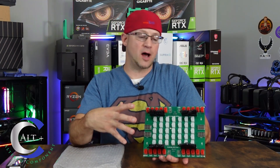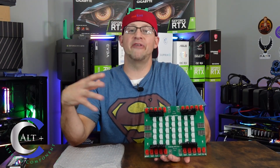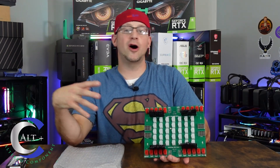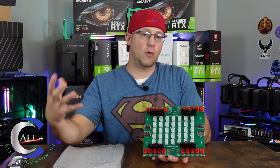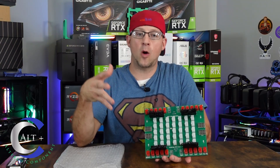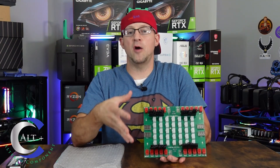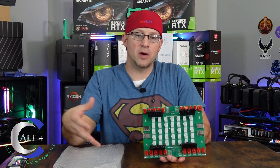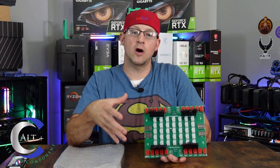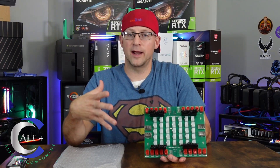This board has two primary purposes. One is to combine your power supplies — again up to 3200 watts — and you can combine power supplies of varying power. For example, you could have a 750 watt power supply, 1200 watt, 1400 watt, even some lowly 460 watt server power supplies all combining into one big power pool. Being as you can use some of these lower, no-name power supplies, it really could be a way to combine lower power supplies — say, using four of the 460 watt server power supplies all at the same time to function for a larger rig.